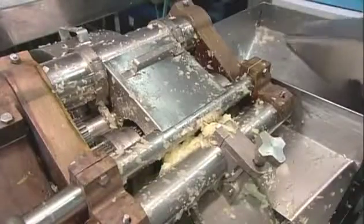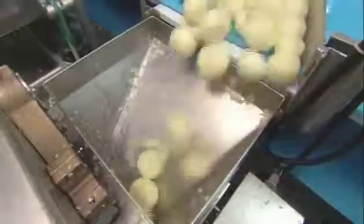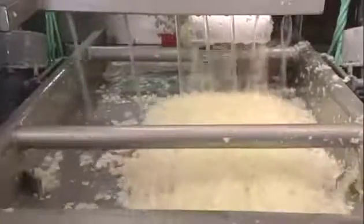On the dicing line, meanwhile, the onions collide head-on with a rotary blade that chops them to bits ranging from 3 to 25 millimeters in diameter. The diced onions then go for a bath in cold water. Chopping an onion releases juice from its tissue, paving the way for bacteria to grow. This cold water treatment reverses the damage, restoring shelf life.